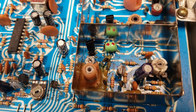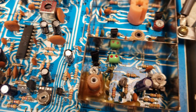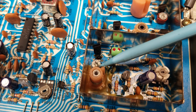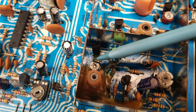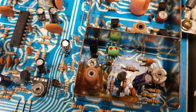After doing some Google searches, I discovered that this is a very common problem with Adcom tuners of this era. A lot of people wind up replacing that trimmer cap. Reflowing the solder seems to have worked for now, but if that doesn't hold up in the long run, it's going to be replacing this trimmer cap and then realigning the tuner.